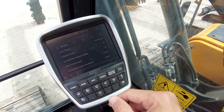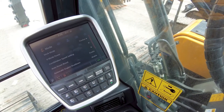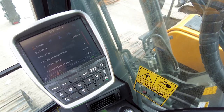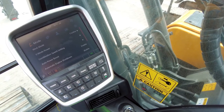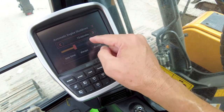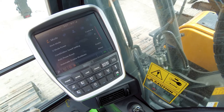The next thing to look at in the monitor — going back to the main mode menu and into the mode menu again — is to make sure that auto power boost is set and enabled. What that does is provide a secondary relief setting: as you start to dig and your pressure reaches the primary relief, it gives you an extra ten percent of power for a period of eight seconds at a time. It'll cycle off and come back on within about a second. We recommend turning that on for maximum performance. This is a stage five machine so we don't recommend excessive idling. It's a great idea to set your automatic shutdown — we usually set it at about 15 minutes — so when you don't touch the controls for more than 15 minutes the machine will automatically turn itself off, helping reduce issues with the after-treatment system.